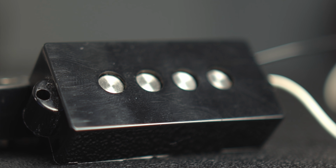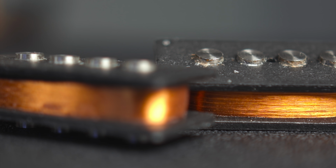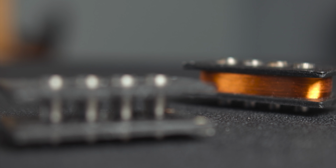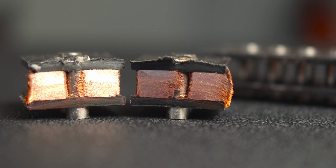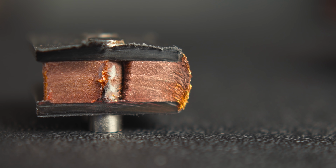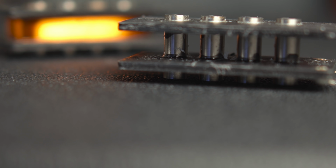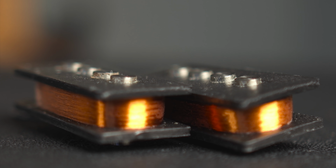All magnetic pickups, whether they be passive or active, are built upon the same foundation: magnets and copper wire. By playing with magnet strength, magnet materials, the number of winds of wire, and the thickness of wire, you can influence the tone and output of the pickup. Stronger magnets and more wire will give you higher output, but typically sacrifice sustain and or clarity. Now, I'm not a pickup builder, engineer, or scientist, so a lot of what I'm gonna say just paints with broad strokes and touches on the theory, but essentially, stronger magnets and more turns of copper wire is generally going to result in a higher output, but sacrifice in clarity. Conversely, if you go with a weaker magnet and or fewer turns of copper wire, you're definitely going to start to get some of that clarity back, but sacrifice the output signal. So finding the sweet spot of sustain, output, and clarity is definitely where the art of pickup manufacturing comes into play.